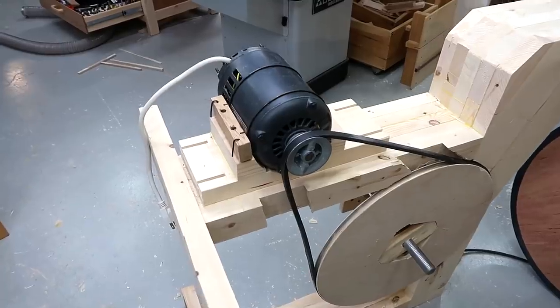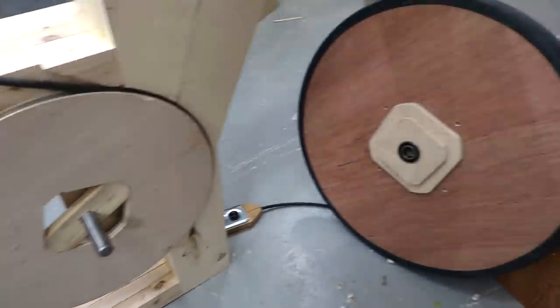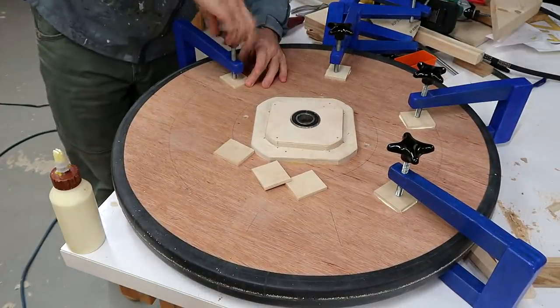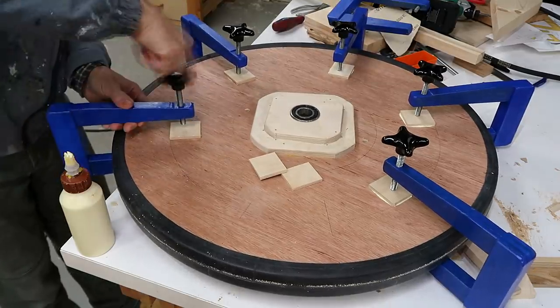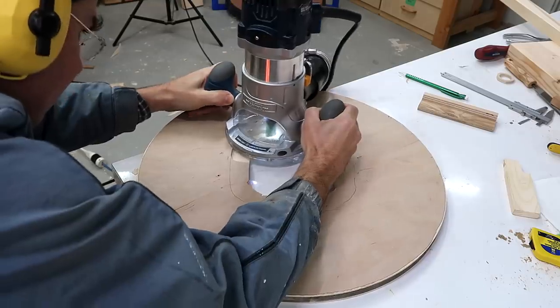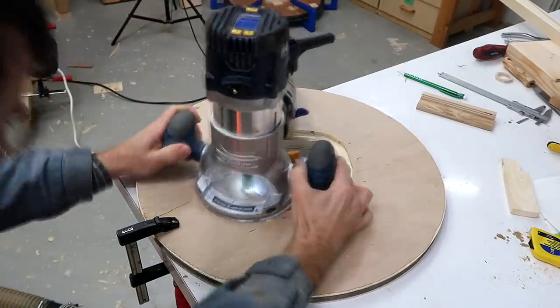Now that I've figured out how to mount the motor and made a space for the lower pulley, I have to mount that pulley on the lower wheel. I'm mounting that pulley about 9mm offset from the wheel, and these things are spacers and also for screwing the pulley to. But the flange is actually a little bit thicker so I have to route a little bit out of the pulley to make it fit around the flange.